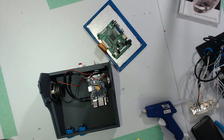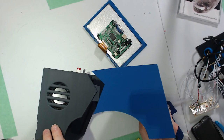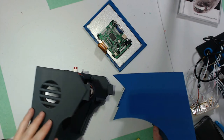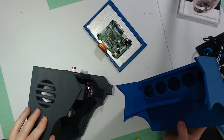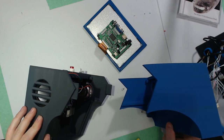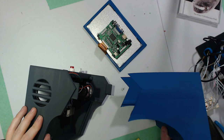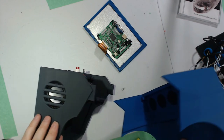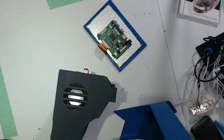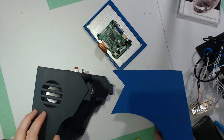Now it's time to think about putting these two pieces together — we've got the top and the bottom and they fit together just so. I've added plastic tabs on both sides for more surface area if you want to glue it. You're going to have to glue it in some fashion: there's always the crazy glue option which is permanent and strong, but if you think you'll want to do work on it later, it may be better to go with something less permanent. I'm going to stick with the hot glue approach. The hot glue will hold the sides in, and then the screen and back plate also screw into the top and bottom, giving it a lot more rigidity.